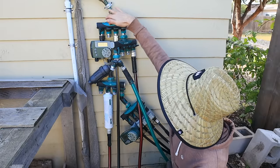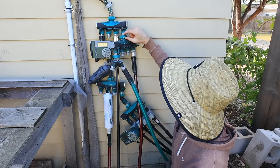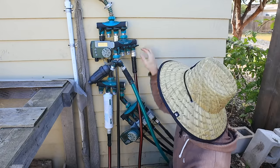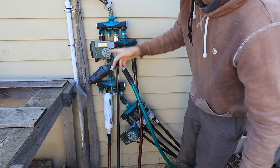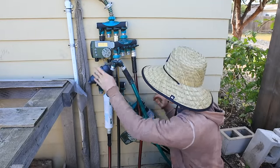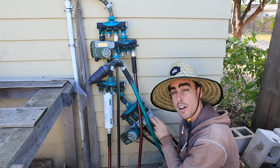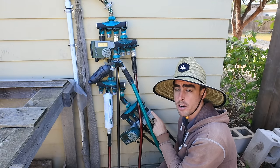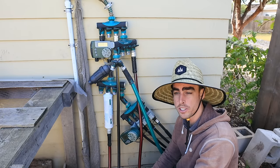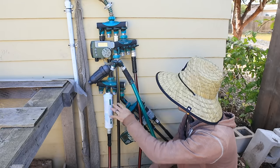If I do this in the future, I'm just going to build these manifolds out with PVC. It's way cheaper and way more reliable. Sometimes these fittings would fail. It has worked pretty well for splitting the water off. It comes down here and has to go through two timers just because the filter can't be under pressure. For the timers I'm using, I'm using an Orbit 1-valve and an Orbit 4-valve. The 4-valve is my favorite — these valves have been very reliable, I've never had an issue. If there ever is an issue, you can replace each electronic valve, which is really cool. The batteries last forever in these Orbit timers. These are the original ones I've had at my farm for over three years.